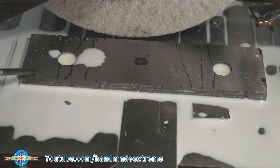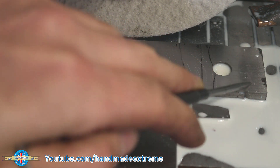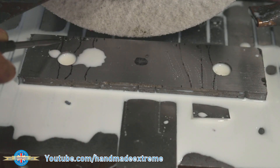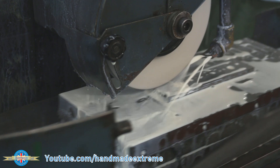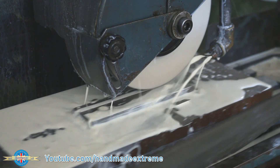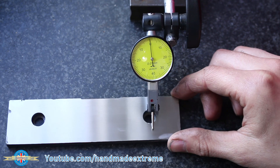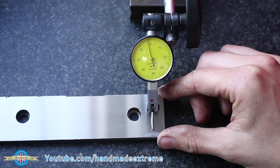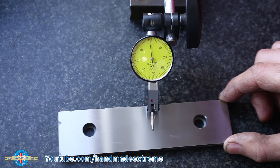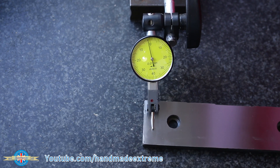I've done a few passes and you can see the 5 and 4 lines and the 8, 7, 6, 5 on this side have all gone at the same time. We've worked our way in and the 0.03 line is here, so those should go together, then the 0.02s, then the 0.01s - meaning I'm taking the same amount off each side. Looking top to bottom that's looking good. We've gone maybe 0.02 low - and we've managed to go the other way. Fantastic.